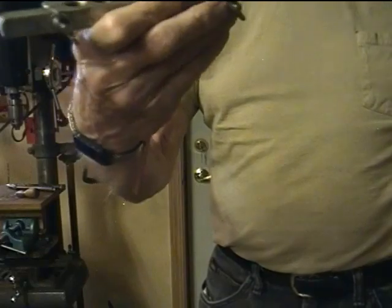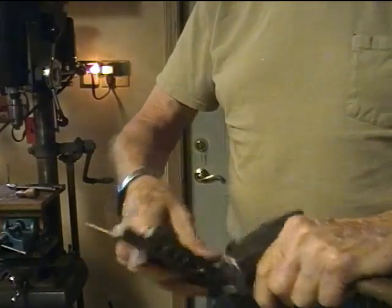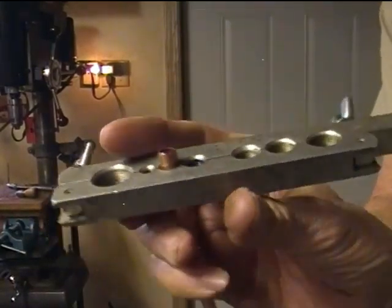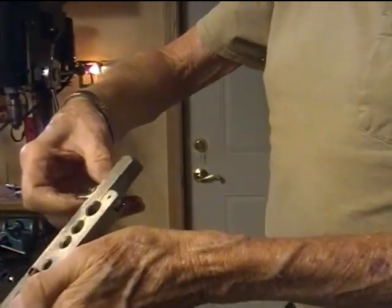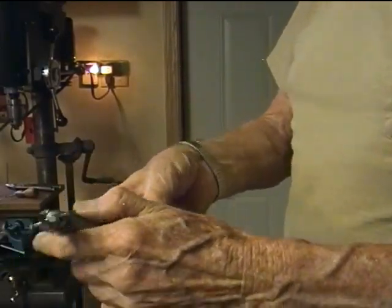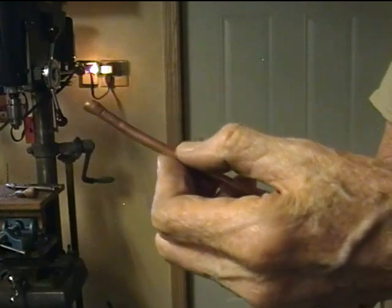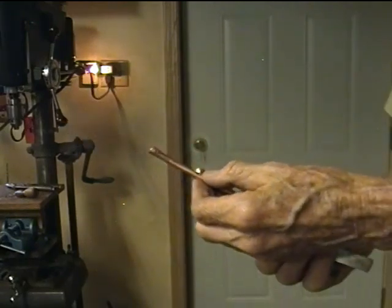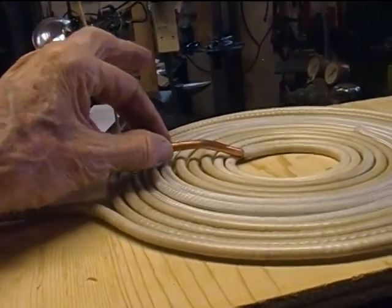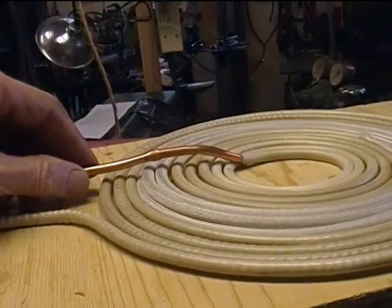I think that's plenty. That's my little swaged piece of copper pipe, so I'll just take it out. Hitting like this does kind of mark the pipe a little bit, but we really don't care in this application. Let's see if it fits — and it goes right on there. It's pretty snug, so soft solder is going to make that work out just fine.